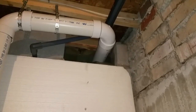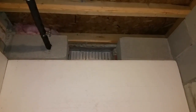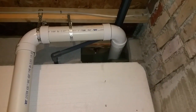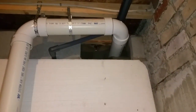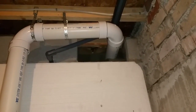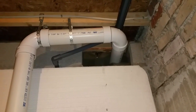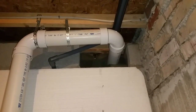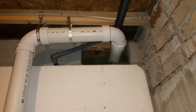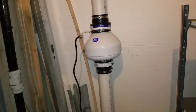With the air going outside, I ran the pipe right to the edge of a grate. On the other side you can see a grate just like this — I used foam stuffed around it so air doesn't come back in. Please note there is a grate there, and I've stuffed the pipe right up against it. If you run the pipe right outside the house, which is probably recommended, be sure to put some kind of grate or cover on it so mice don't come up through that warm airflow.